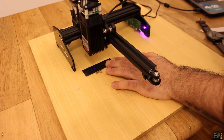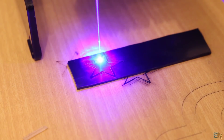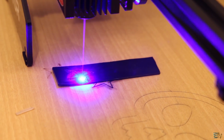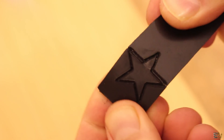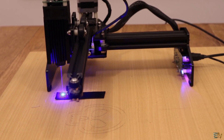This is a piece of 2 mm PETG plastic from an old liquid container. With full power and medium speed, the laser is able to cut through this material quite easily. But the problem is this plastic melts very easily and just glues itself back because of the melted plastic. So even though it cuts through, you still have to pry out the cut shape that melted back.